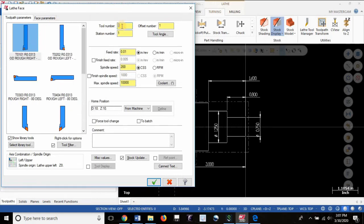We want to change the tool number to reflect what position within the turret this tool exists. So if it's tool number 4 in your turret, call it tool 4, offset 4, station number 4. For all intents and purposes at this point in your career, you probably want to make sure all those numbers match.